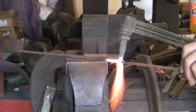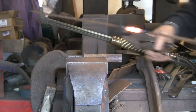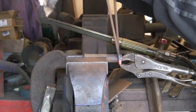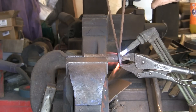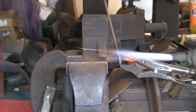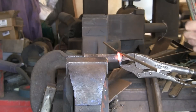I still can't work out what's wrong with this camera — I've got an IR filter on it, but it still looks much hotter than it actually is. That looks like it's almost white hot, but it's actually just over orange. Anyway, clamp it on, pull them both up as far as they'll go — don't go too far. Heat them up again and just pull them around so they go sort of level again, so you've literally just got a loop in the bottom.